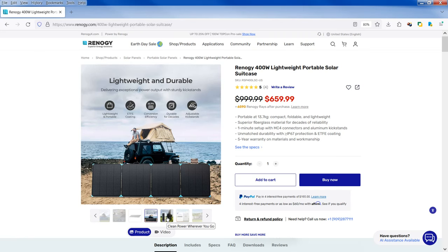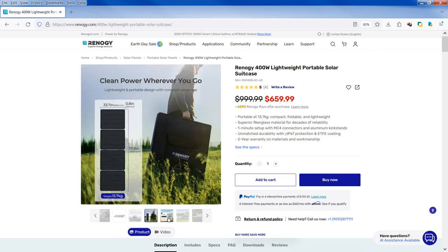You can use a soda can, a soup can, beans, corn, anything you have that's in a can. Coffee can, you set it on there, and when the shadow disappears all the way around the can, that means you're perfectly aimed at the sun the best you can, obviously without lasers and all the fancy stuff, but it's very efficient, very, very good. Let's see what else we got here.